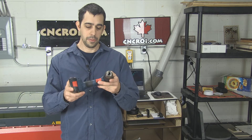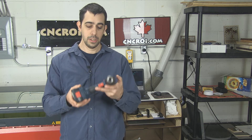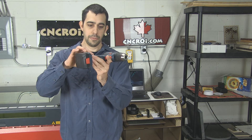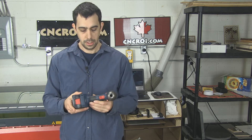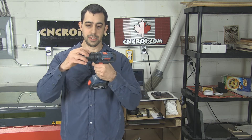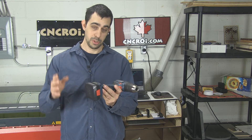The additional challenge we have with laser engraving or color changing materials on a tool is that we have no idea what kind of plastic it is. For wooden tools it's very straightforward — we have a ton of tolerance. But for something like this that is mostly plastic enclosed inside of metal, you have one kind of plastic here, another one here, another one here, and they all react differently to the laser. So generally what we do is engrave more than one section and use different tubes. Because we have a fiber and a CO2 — if I did the top here as a CO2, it would not be legible. It would just burn the living hell out of it. So we have the fiber which color changes the plastic without melting it, for most plastics.